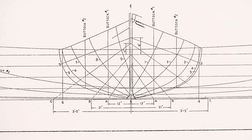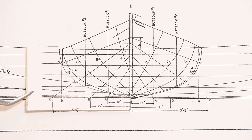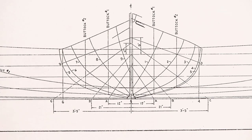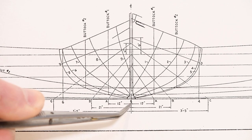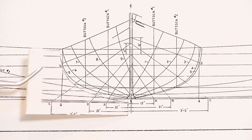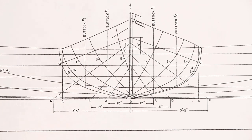While you're watching me chew up that block of wood in the vise like a beaver on meth, I thought this might be a good time to say a word or two about the templates I'm using. As I said, they're copies of the plans glued onto bristol board and cut out. But they're cut to the center line of the boat, not to the outside edge of the keel. The edge of the keel is really quite a distance from the center line of the boat. If you made your templates to that edge, you'd wind up with a hull that's a good deal narrower than it should be, and you wouldn't even be aware of the discrepancy until it came time to fit all the interior details — by which time it's just totally too late. So remember: the center line, not the edge of the keel.